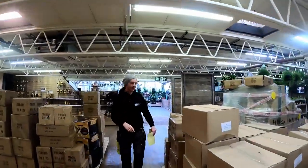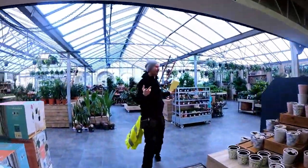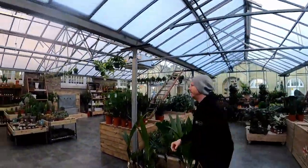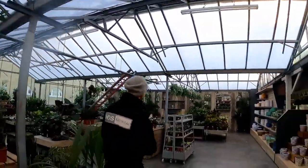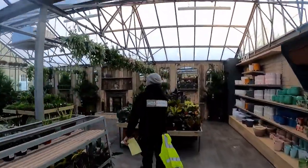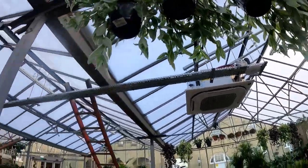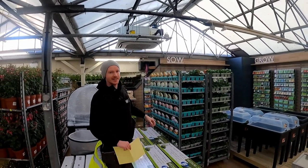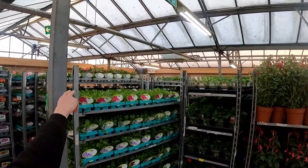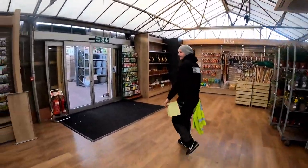This is the plant room — not to be confused with a plant room that has boilers; this plant room has actual plants. Up here we've come along with the air conditioning system, doing our best to minimise it. On this side we've got two sets of cables: two for an access point, two for a phone system. As before, we've got a backup for everything. We've got one of our racks over there with the Cat6a coming in, plus two purple and two orange cables going to another phone system and another access point.